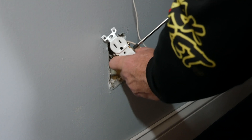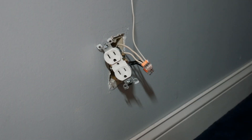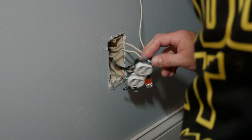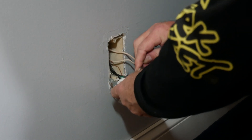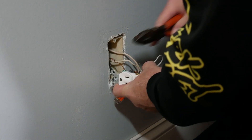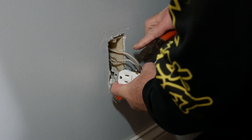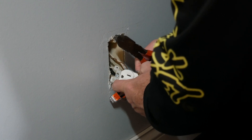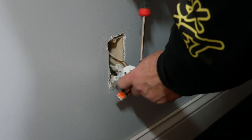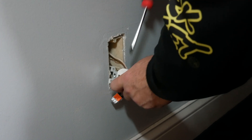So if you want to remember which side is hot and which side is neutral, the bigger side is always white. Now we'll put this guy on here the same way, on the same side. So now it's down there. Let's make sure that's tight and then we'll double check this. This guy was loose - good thing we checked it.